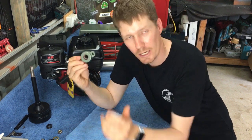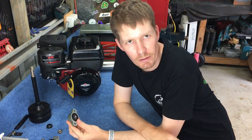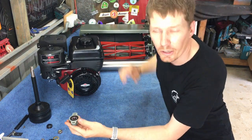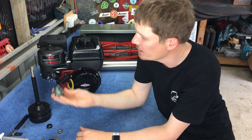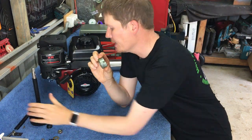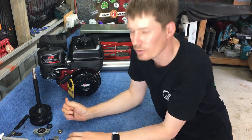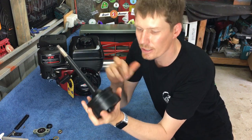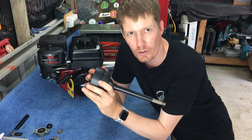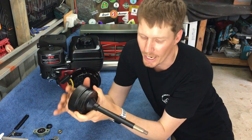And then that's it. So now we've done that, we're almost done really, to be honest. It's just a matter of bolting our engine up on the mower, and then pushing everything through as it goes. I'm not sure if this is a good idea or not, but I'm going to mount our centrifugal clutch onto my motor first. I might just loosely do it there, I won't do any grub screws up. And then once I've done that,